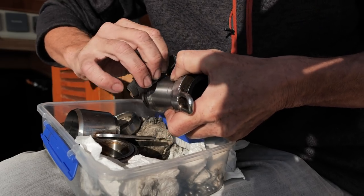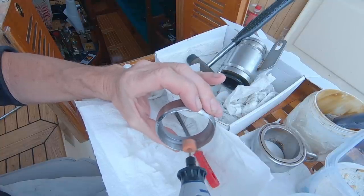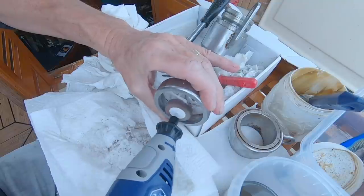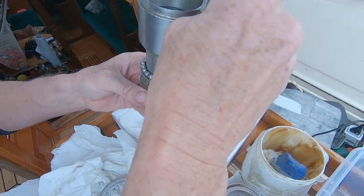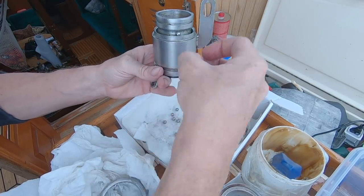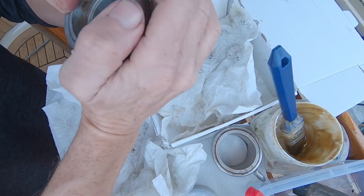It was just made too tight — must have been pushed onto a press and couldn't really be got off. At some point in the future I'll be looking for a machine shop to fit some larger ball bearings, but for now we're just going to smooth stuff out and hopefully get it running a bit smoother. I'm using winch grease to lubricate the whole unit — it's nice and sticky so I can hold the ball bearings in place while carefully putting it all together. It is important that furlers run easily so you can furl them up quickly by hand.